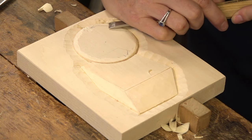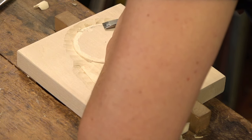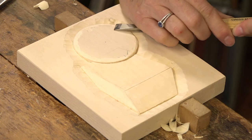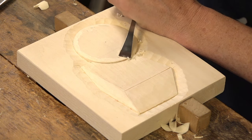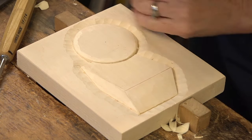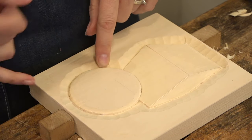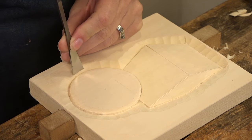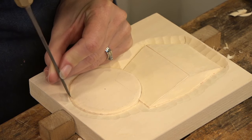There's no rush — just take your time and find the shapes. I'm also trying to blend it into the flat surface so there's not an obvious transition between the outer curve and the surface. I also want to do a little aggressive undercutting, because this is supposed to represent a ball — if you can see those outer edges it loses the illusion. A little undercut will give it that much more dimension and create a lot of shadow behind it.